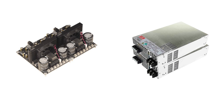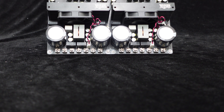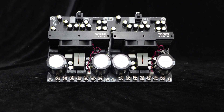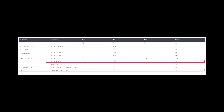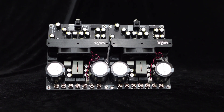We will also demonstrate how to power the IRS 2092 amplifier with two Mean Well power supplies without using a transformer and rectifier filter board. This dual-channel 750W IRS 2092 amplifier board adopts a Class D topology combined with professional PCB layout, achieving a high efficiency of up to 95%. It can provide low distortion, high-fidelity audio playback with an SNR up to 99 dB and THD plus noise performance reaching 0.032%. Therefore, this amplifier board can fully leverage its outstanding audio performance.